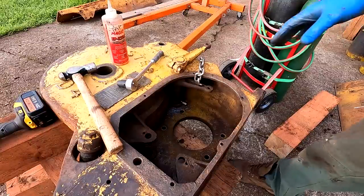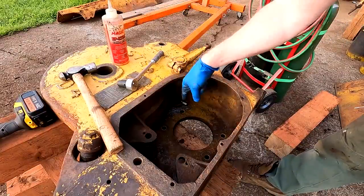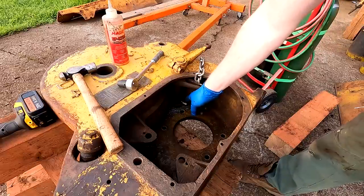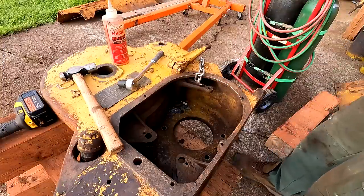While I was pressure washing, I forgot I had to take the shaft off. I think the shaft's supposed to come out that way. There was a lock nut on here and that snapped right off. So I have an extractor in it now. I'm going to heat this up and hopefully I can get it out.